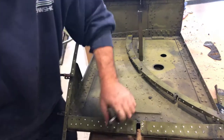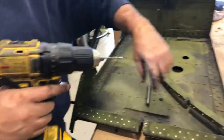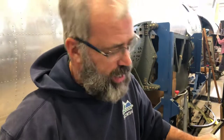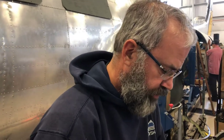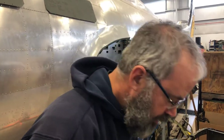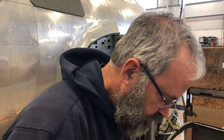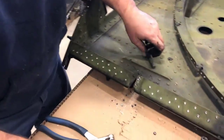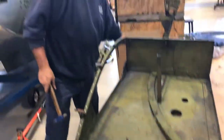What size drill bit are you using when you're doing this? It depends on the size of the rivet. We've got 40s, 30s, 20s, sometimes 25 — number sizes on the drill bit. So it's a number size as opposed to a fractional bit. You definitely want to make sure that the hole you're drilling is smaller than the hole that the rivet fills.